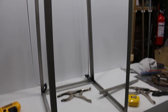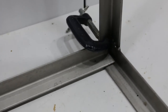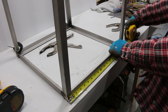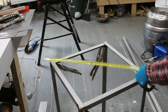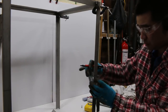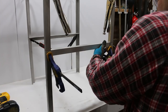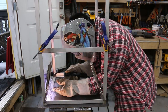Once I got the two sides made, I made a rectangle box using angle steel between the two sides. It's an 18 by 18 inch square on the top and the height is around 26 inches. I'm measuring for squareness to make sure it's a perfect 18 inch square — you measure the diagonal. I'm measuring about 13 inches down to mark the braces. These braces also double as the burner mount. I clamp it in place, double check for squareness, then tack weld everything into place.